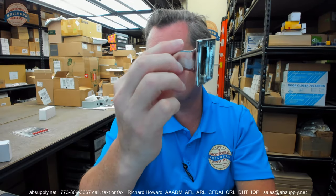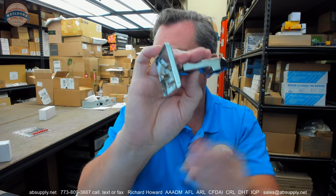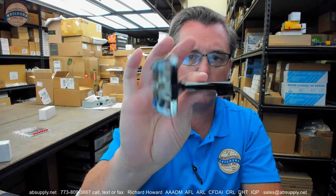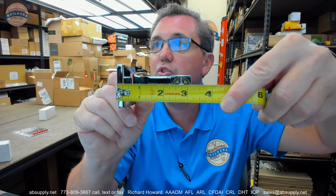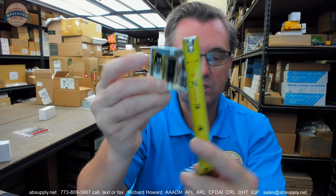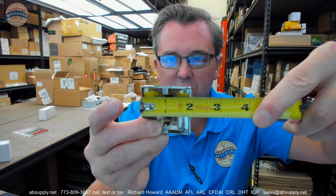This is going to be a ZAMAC base material — actually they are saying it is zinc die cast. A polished chrome plating over zinc, which means it will be non-ferrous. It is relatively dense. The overall projection of the mounting post is about 3-1/8 inches. The overall height of the base is about 1-13/16ths by about 1-15/16ths, so it is not square.